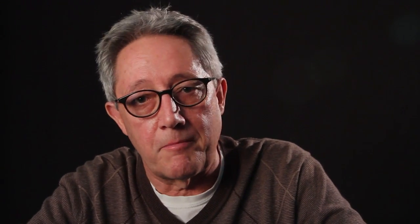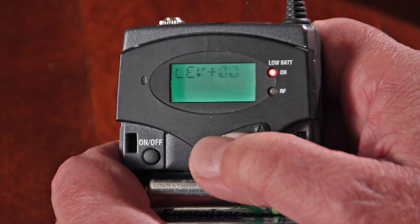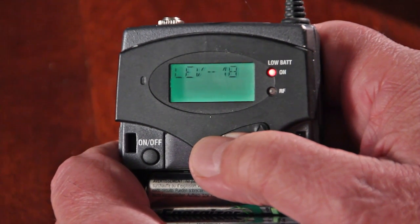The only way to go into a Zoom using front-end equipment is through the quarter-inch phone plug. The tricky part is that the Zoom input is not line-level — it is less. It is designed to receive the output from an electric guitar or keyboard. So if you are using pro-level front-end equipment like a field mixer or wireless receiver, its output must be adjustable downward in a range of 10 to 25 dBU. Alternately, you can use attenuated patch cords, though different setups will need different levels of attenuation.